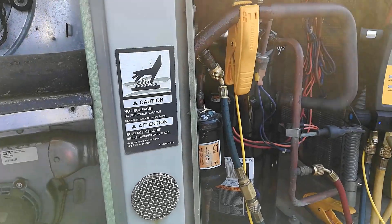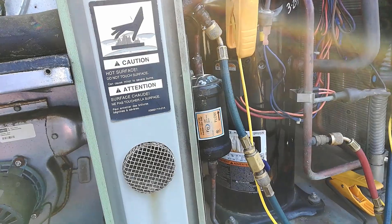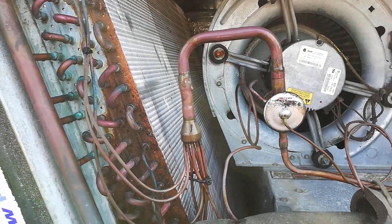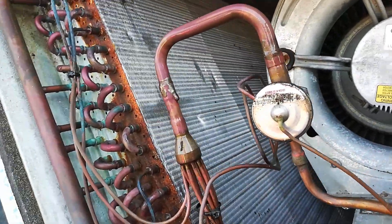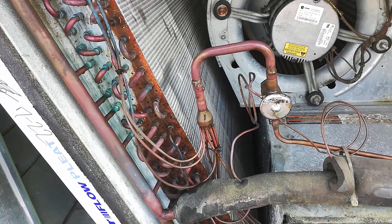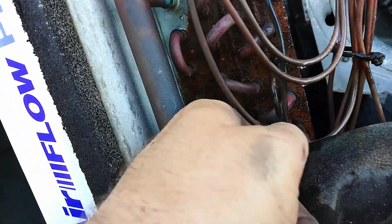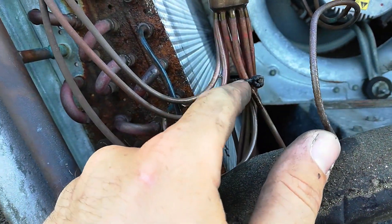Filters look nice and clean. I've got the factory dryer to put back in instead of a 3.8 — hopefully I've got enough to work with. The TXV is going to be nice and simple to put in, though it is brazed — there's nothing mechanical about it. No big deal. I'm going to take a look at all these little tubes and make sure they've got no rub-out points. Right there, those guys look like they're touching quite a bit — giving each other a good rub. This has gotten hot at some point.